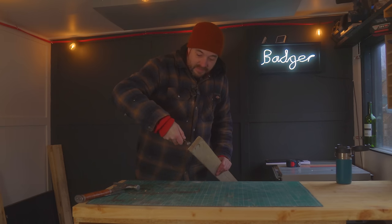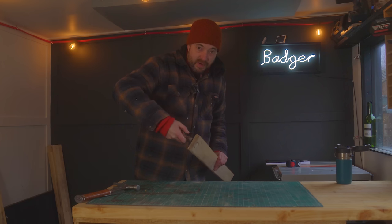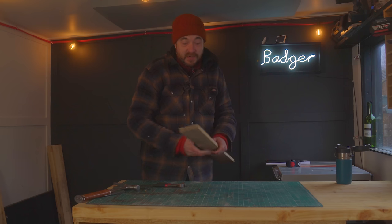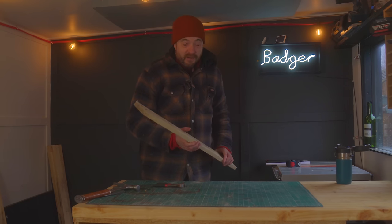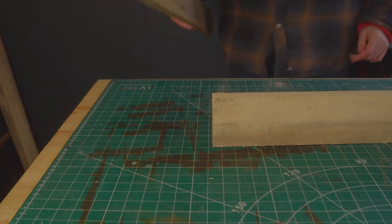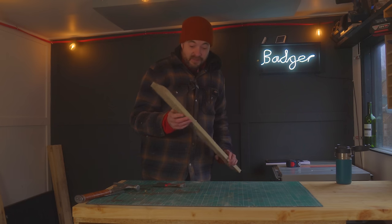This is going to be a pretty simple construction. Two long bits are going to be the shelves — one for the wine and for the placemats to go on, the other for some wine glasses. So I've got my measurement of how long it needs to be. I'm going to knock off a few centimetres because I want end bits, and then I'm going to get two bits cut to length on the table saw.